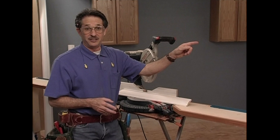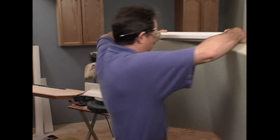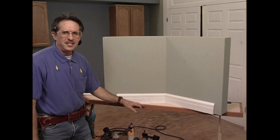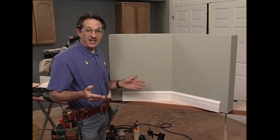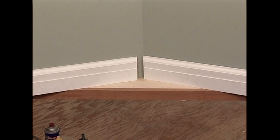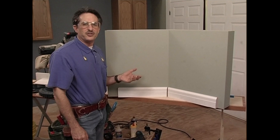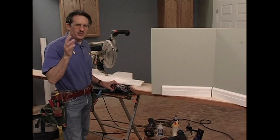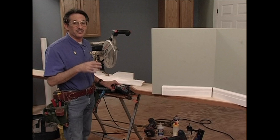There's a really valuable lesson to be learned from that corner angle. Take a look at this little set I built. You probably call a wall angle like this a 22 and a half, right? Some of you might even call it a 45. That's because the miter is a 22 and a half, and both miters make it a 45 — wrong. Not true at all. This is a 135-degree corner. The reason you think it's a 22 and a half or a 45 is because the numbers on your miter saw gauge are all wrong. And those numbers have confused you and other carpenters for years. Lots of carpenters, myself included, have a tough time understanding angles, and these numbers make it nearly impossible.